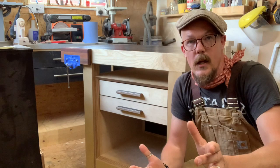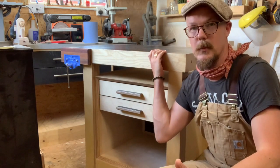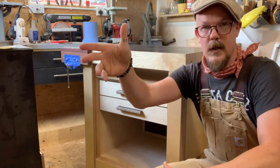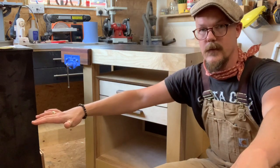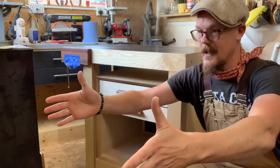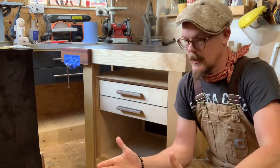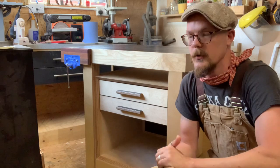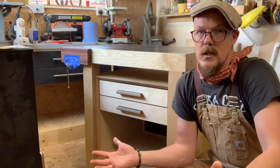Right, I hope you enjoyed that. Unfortunately, I couldn't show you the build of the slab top. I did film it, but I've lost the film footage. I actually took advantage of the fact that I had a flood in my house. I had the floor up, so I had a nice flat concrete surface to work on. And I just cut the MDF to size, laid it out, plenty of glue in between the layers and lots of weight on top, clamped so that it wouldn't slip and slide, with a little bit of salt in between the layers to help as well. Fairly straightforward, but apologies, I couldn't show you that.